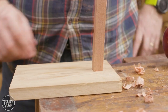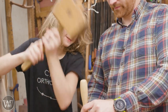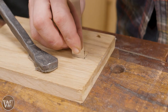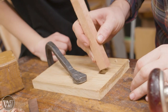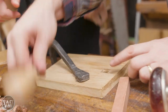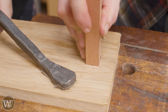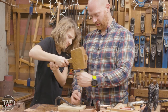How exactly do you put a square peg in a round hole? Well, let's fix that. We're going to pull out the holdfast and lock this down in place on the bench and start chiseling it out. When you're first getting started, it's easier for someone else to hold the chisel and someone else hold the mallet. Then you have someone hold the chisel while you hold the mallet, or vice versa — you give one half of the project at a time. Rather than trying to learn both hitting and chiseling, it's just easier to do one or the other. We're going to square it out until that peg fits in, then turn the block over and chisel from the other side, so we have a nice square hole for the vertical to slide all the way through the base.